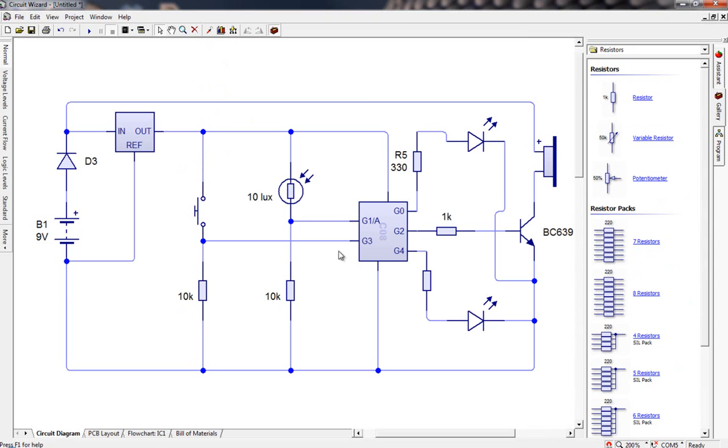What do we want to happen next? Once we've flashed a whole bunch of times, that's given the person plenty of time to put the alarm into the drawer and close it. So the light level that the LDR is picking up will be right down at this moment — it might be zero or very, very low. What we probably need to do is store the amount of light that's currently available, taken from input one, and once we've stored that, the alarm is set.